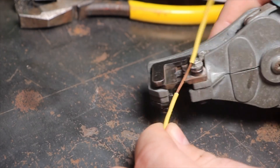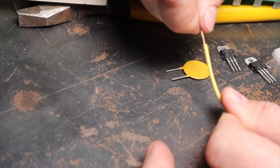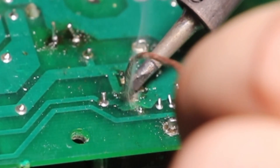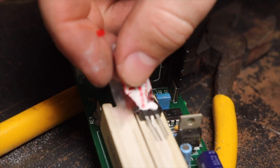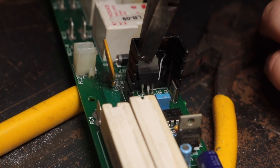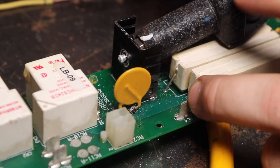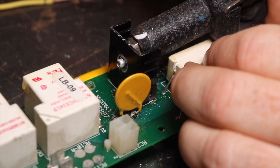There are some other repair options like replacing the entire board. But for now, we're going to talk about how I made that solder wick, which is just some exposed wire twisted, smashed, and filled with flux so that the solder just flows off the board and into the wick. I had to work a lot harder to get the solder out of each hole, but it eventually worked, at least well enough. Now I'll put some heat paste on the back of this transistor and rivet it back in.